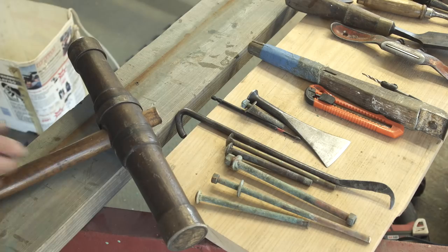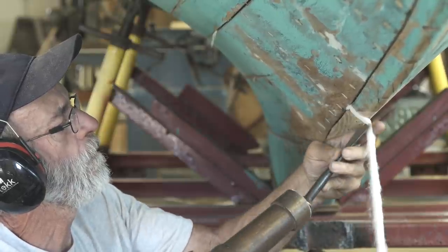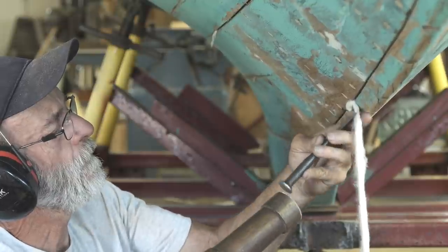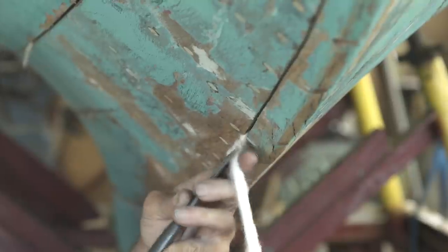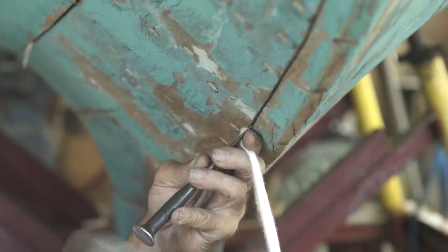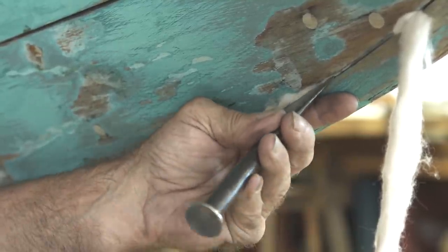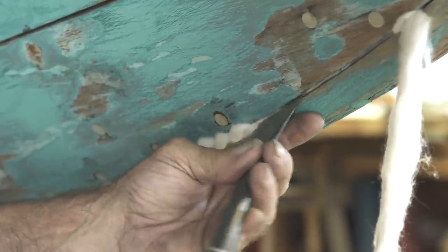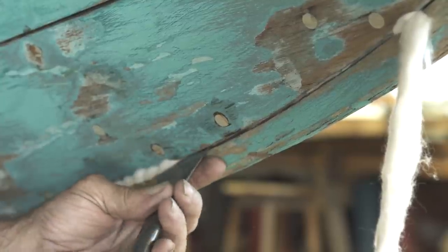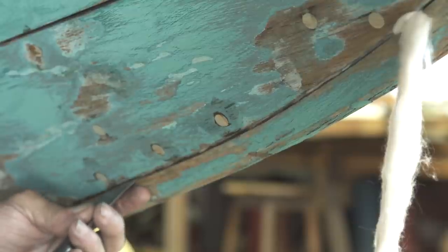I'm putting on a headset because this beetle — this is what they call a beetle, it's a caulking mallet — it chirps at you, and it's got a really terrible chirp. Some mallets are way worse than others. You don't want to be caulking any extended period of time with a mallet like this without ear protection, because when you're done you're not going to be able to hear anything. I'm driving the cotton in exactly the opposite direction that I first set it into the seam, because I'm trying to get the cotton to seize against each other — each loop against each other, becoming tight. You can't just drive one loop all the way in and then another loop on top of it. You have to set it part way into the seam and then go over it again with your caulking iron and mallet.